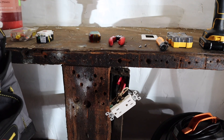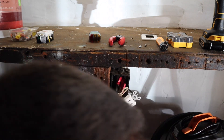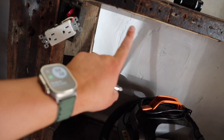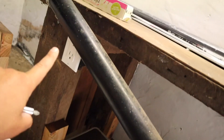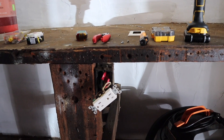Now what I'm going to do is take off this outlet, but before I do that I'm just going to look at the wiring and see what's going on. It looks like over at the breaker box we have the wire coming out from right here, going down and over to this outlet. Then we have power going from here to the next outlet, and then to the next outlet, and then it stops. For this reason I'm only going to install the GFCI outlet on this first one.